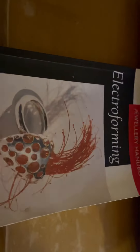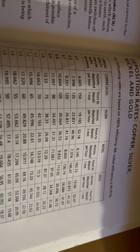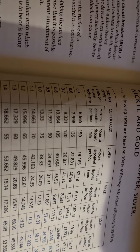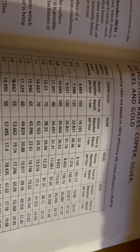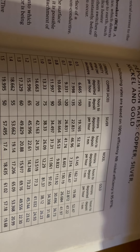This chart is from the book Electroforming by Leslie Curtis — this is an excellent book, it's a gem. So for example, at 0.5 amps per square decimeter in the acid copper bath, assuming 100% efficiency, it's going to deposit 6.665 microns per hour, and it will take 150 hours to deposit one millimeter.